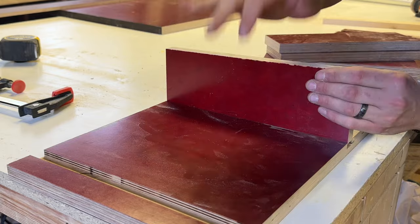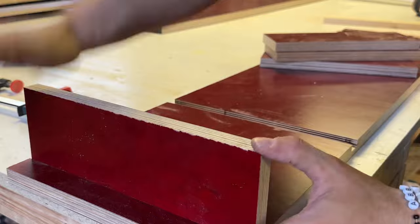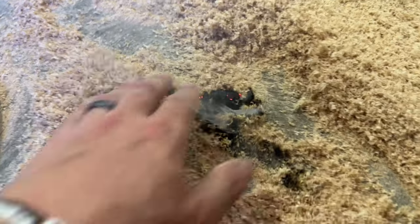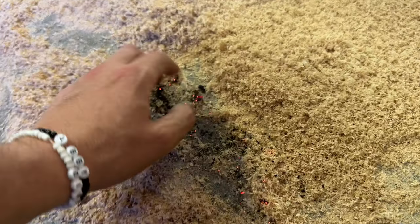After checking the fit of the risers I left the shop for a few minutes to get some food. When I returned something really scary had happened — there was smoke in the shop. Routers can sometimes cause enough friction to start a little ember. I've seen this happen before but never unnoticed while I was gone for 15 minutes. A little ember had started smoldering in a pile of sawdust. This was really eye-opening — if left longer this could have led to tragedy.